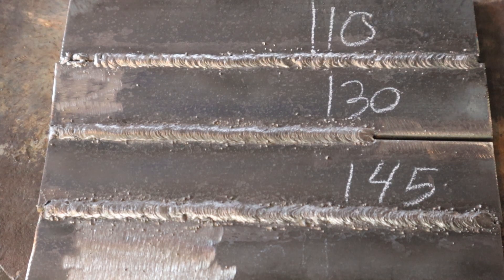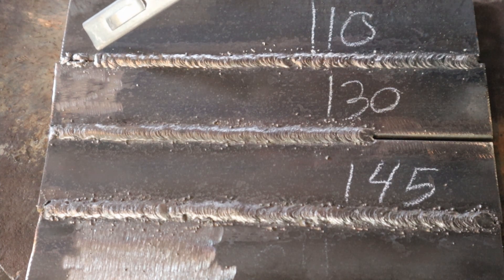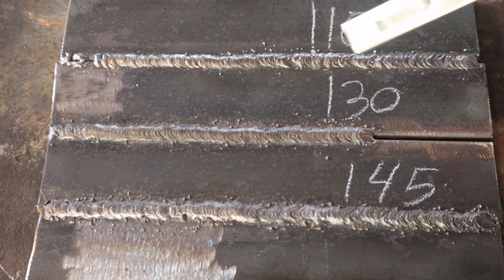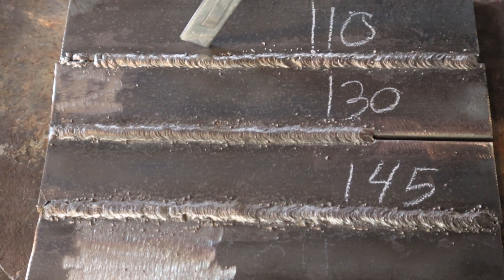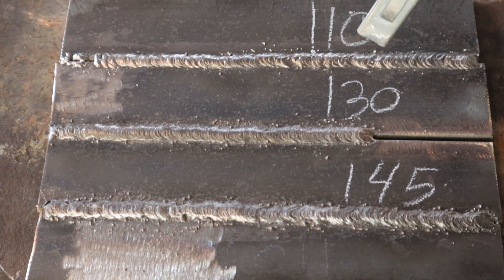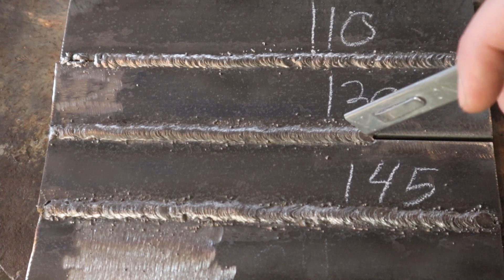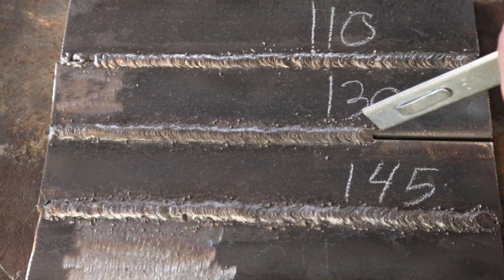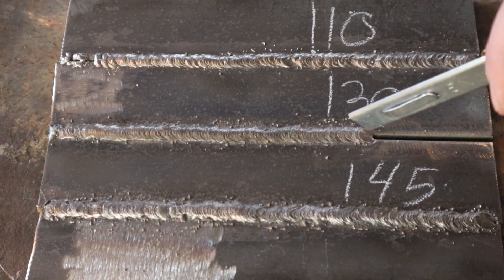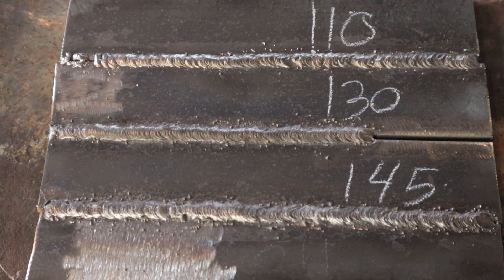When I tried welding at 90 amps and about 18 volts, it wasn't enough amps to actually melt the metal. But when I turned it up to 110 amps, it was able to actually begin welding. I've used a machine like this before — a Harbor Freight machine — and it used AC current instead of DC current, which this one uses, and it's so much better and easier to control. The DC inner shield welding wasn't difficult; the spatter just flew off as soon as I hit it with the wheel. I increased it then to 130 amps, and I think this is the sweet spot — the best fusion and most consistency out of either of the amperages I used.